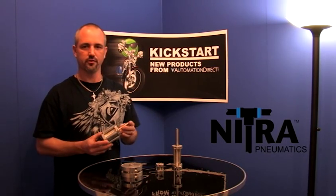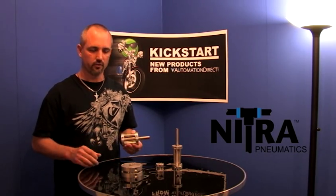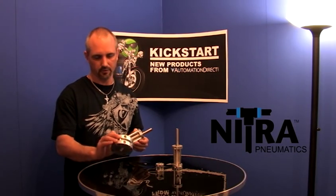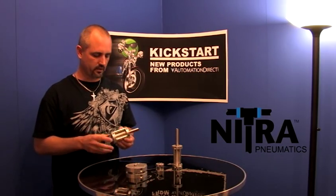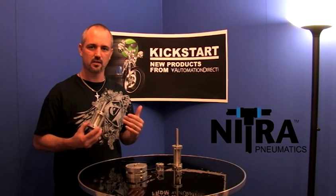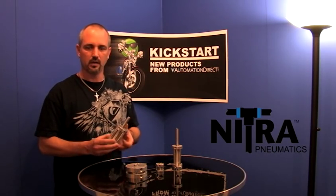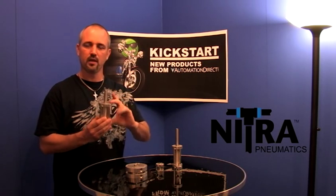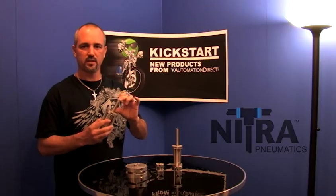Compact air cylinders are often referred to as mini-cylinders, mini-actuators, flat-style cylinders, or even pancake cylinders, as you can see how these look. The upside to using a compact air cylinder is it's going to work the same as a standard air cylinder, but you'll be able to fit it in a much tighter space because they have a shorter length. The downside is that they are limited to a shorter piston stroke.